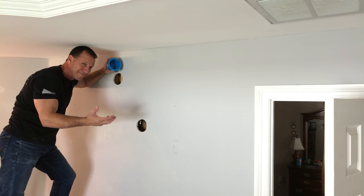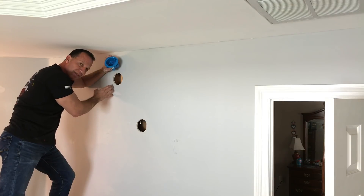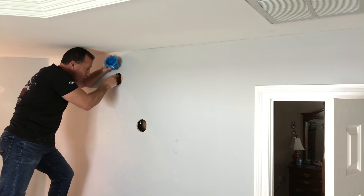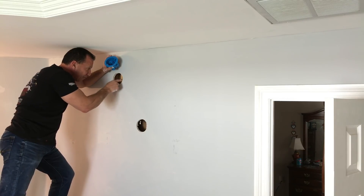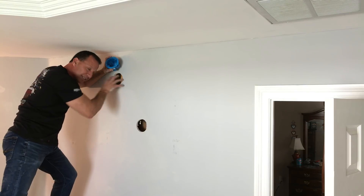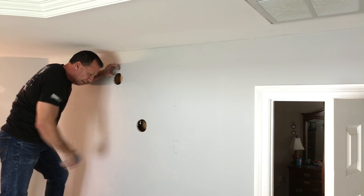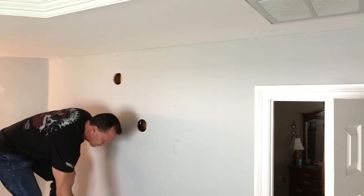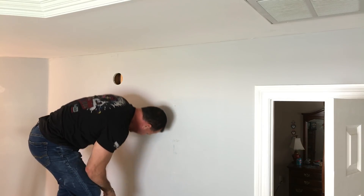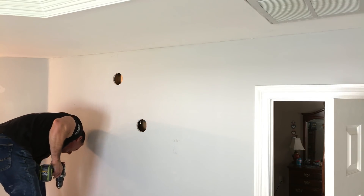You see my dilemma — I'm going to have to get into here. I can't use a pop-in box; I don't want to scoot this over and have it off center. I want it centered in my mirror. So I'm going to use the hole saw and get down as deep as I can right here. An inch and a half will do because I can get a shallow box and put it in there and mount it to the stud. I just won't use a pop-in box. There's always a way around things — and of course, with construction, there's always a problem.